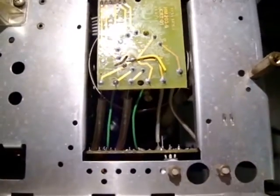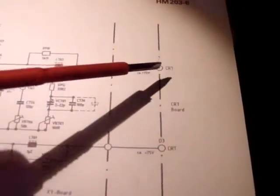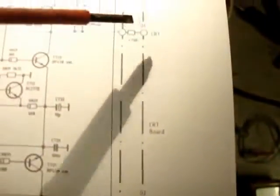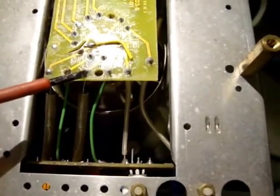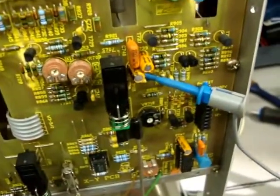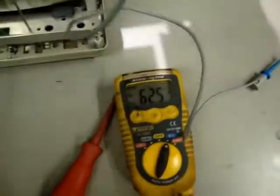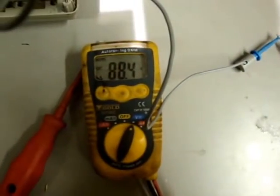Checking on this — D4 and D3 are possibly these two wires here. I've deduced this because on the schematic these two come off straight off the board and then into the back of the CRT board. Whereas down here, D1 and D2 between them have a 475-ohm resistor. Now the only two other lines that have resistors on them are those two, so those two are probably D1 and D2, and there's D3 and D4. So if I stick my meter on there and turn it on, I could possibly see 75 volts. I've tapped onto 0 volts on the XYPCB, and going on the back of here there's 62.5 volts on there. And on the other side, there's 88.4 volts.